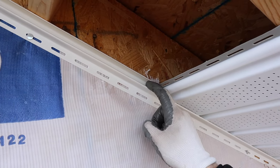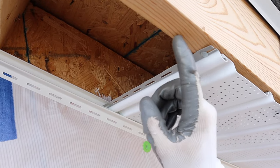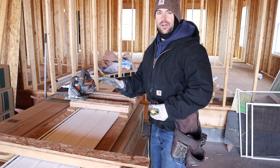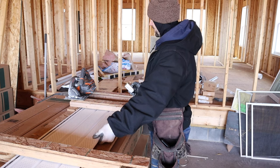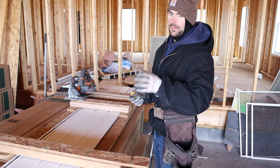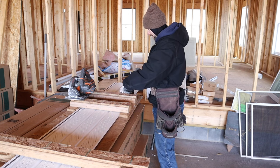Measure from the inside of that F-channel to the edge of the fascia — that's 11 and a quarter inches — then cut pieces to fit in each section of that overhead. I'm going to cut these pieces using my little soffit jig I made. Each cut makes two pieces. If you want to know how to make one of these I'll put a link above. I'm going to cut 10 pieces at 11 and 3/8.